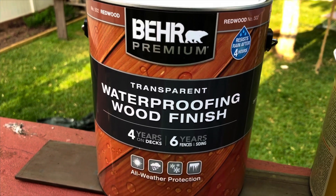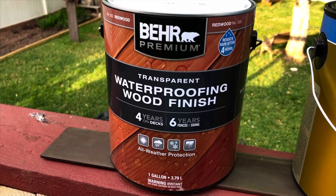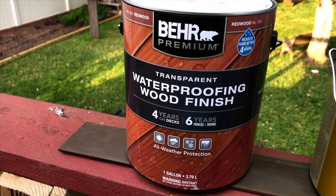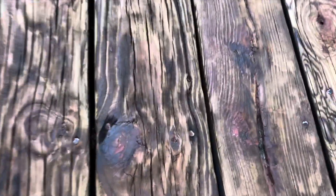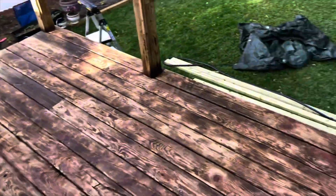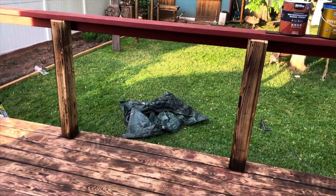I was going to paint it but decided to stain it instead. This is a transparent stain, and the reason I went with transparent is because when I was reading reviews on homedepot.com, the semi-transparent basically acts like paint and covers the wood almost fully. I want this wood to be visible. This is a redwood finish so hopefully it's going to give it a red tint to blend in any red paint that didn't want to come out. This is just for two to three years until wood prices stabilize and then we can rebuild the deck properly.